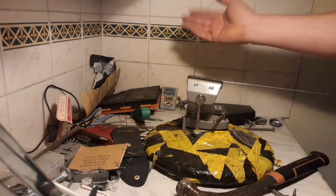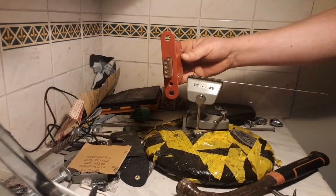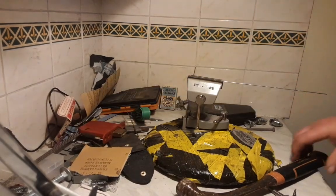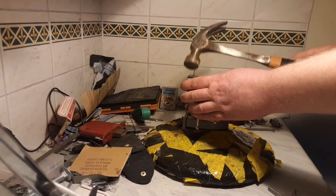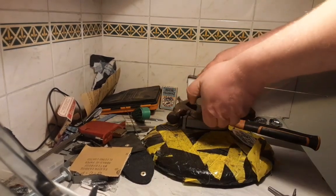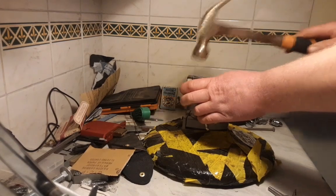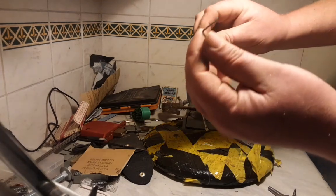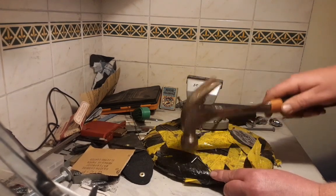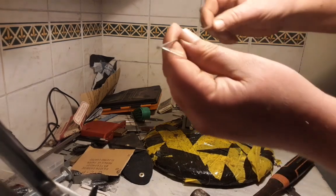Now you need to decide if you want a left-handed wire or a right-handed wire. The easiest way to do it: get a lock and imagine the side. For the lever side, bend it this way; for the bolt side, hold it that way. That slipped - this is the trouble I have putting the bends on, it just slips. So what I do is put a massive bend on it first, then lay it flat and shallow it out a bit.